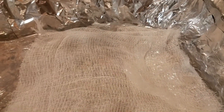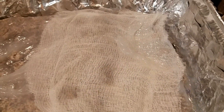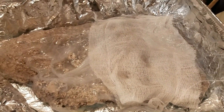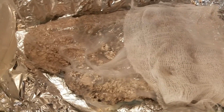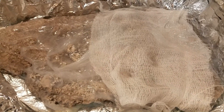I've taken cheesecloth as my mesh that I'll be putting into the mold to make it stronger, so when I go to pull a cast out of it it's not just going to fall apart on me. Step three is going to be putting another layer right over the top of this one. I'll put a little bit more mesh on the back of the foot and then start my next layer of silicone.